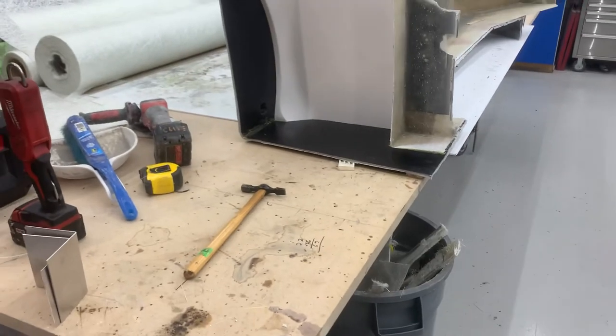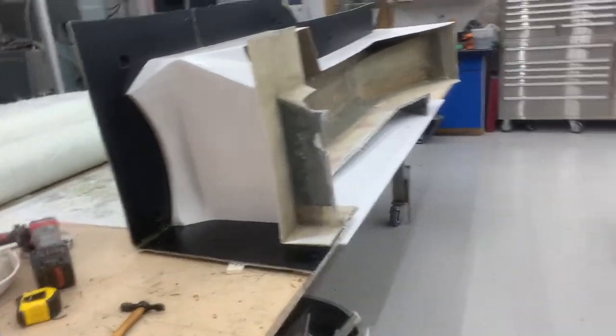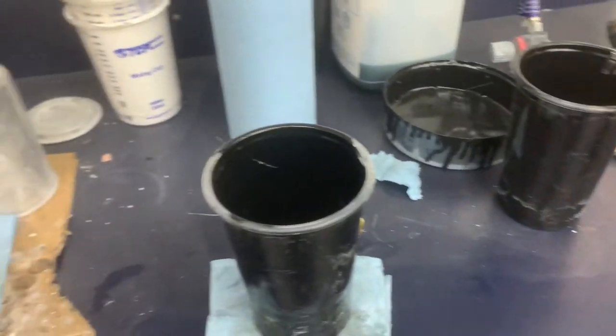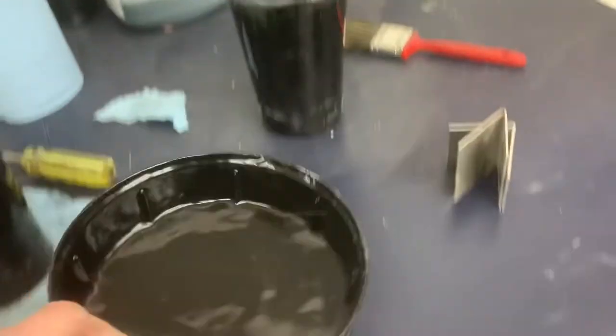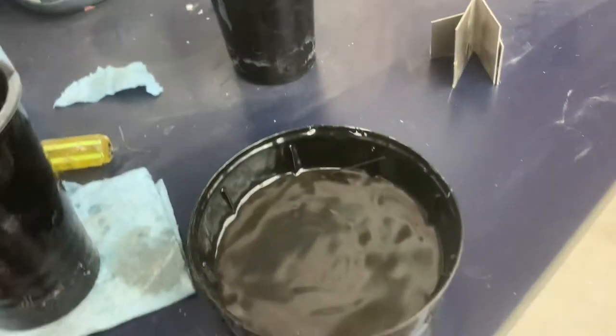First time I put one layer on top of another layer I've had a lot more success with it not reacting. There's a tiny little bit of reaction, but basically: as I mix the gel coat, I think what I've previously done is used a brush in the pot and managed to remove some gel coat that wasn't quite mixed properly with the catalyst. That stuff won't go off properly. So what I've done is mix it in one pot, then pour it out into a more horizontal tray — anything stuck to the sides is the stuff that won't cure.